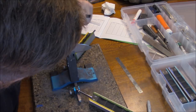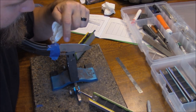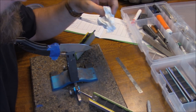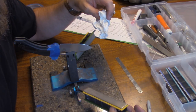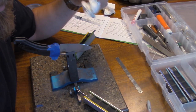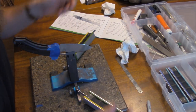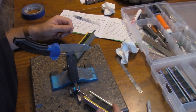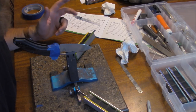Check every so often — you'll be able to see the difference in scratch pattern and the size and depth of the scratches between grits. When you stop seeing the lower-grit scratches, you know you've done your job and can move on. I'll take a few more passes and then move on to 800, then 1000, then the 1200 and 1600 grit ceramics — and that's when I'll check back in.